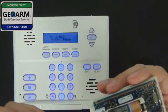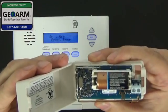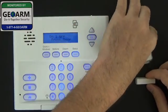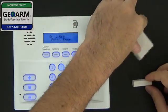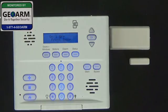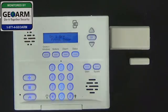Now we're going to locate the side of the contact that has the groove and simply clip that right back in. Put that there about a half inch apart. You'll see that the group is blinking. We want it on an instant perimeter setting so that when the door or contact is opened, the alarm system will go right off with no delay. That would be using group 13, so enter 13 and select OK.